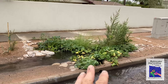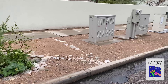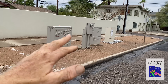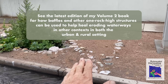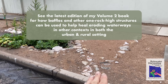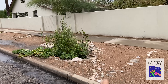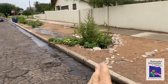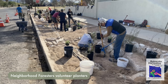Here we've got our final basin, working great like all the others. At the very end, because we've got all these utility boxes, we didn't want the water to continue to flow there and erode that infrastructure. So what is placed here is a rock baffle — again only one rock high. The lowest point is here, the highest point is along the sidewalk. This helps divert stormwater flow that used to create that erosive gully and now diverts more of that water back to the street so we don't have any erosion problems. And we planted all this with food, medicinal-bearing, wildlife-supporting native vegetation.